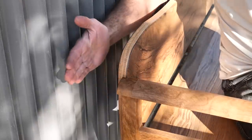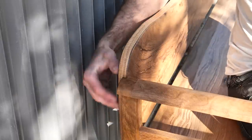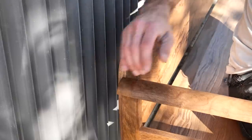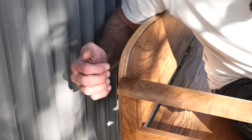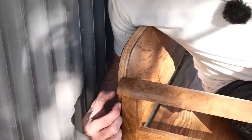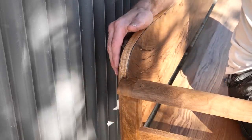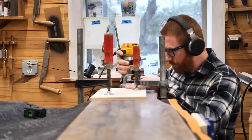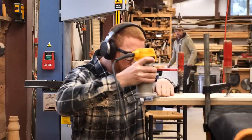The last thing I want to detail on this bench is the connection of this backrest to the leg. In the past, we've just taken the backrest and set it on the back post that matches the profile and just glued it a few inches down and screwed it on. What we did different on this one — and what we're going to do moving forward — is we actually cut a pocket here, a little rabbet that gives you a shoulder for this to set into. I think it makes the bench stronger and it looks better too — you don't see this big seven-eighths inch thick piece hanging off the back, you only see about three-eighths. It looks cleaner and nicer. We made a jig on the CNC to match this profile, used a router, and Robert cut out this pocket and made it fit on there pretty dang good.